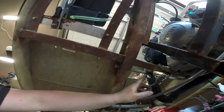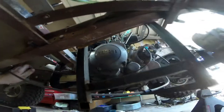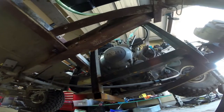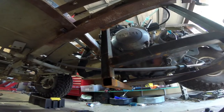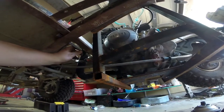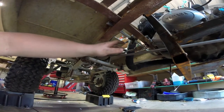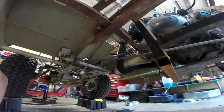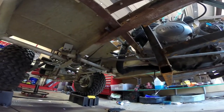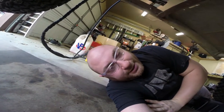We've run into our first problem. This was a great plan except the fulcrum point needs to be somewhere further down, because if I try to line up a guide rod, you can see there's no chance — because of that bottom bolt, there's just no way of getting enough angle without hitting something. We could do some janky thing where the rod is kind of bent, but really all we have to do is move this thing down about two inches. I really do like having this mounted in the frame — it's a good pivot location — we just need to move it down. So we're going to cut this off and weld in a little two-inch spacer. That'll put it somewhere down here, which gives us a pretty straight line and a good shift feel. This is why when you're fabricating custom stuff, until you get in there you really don't know.